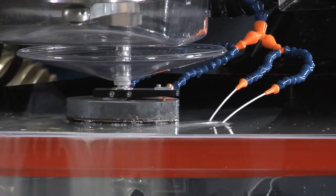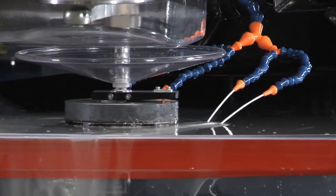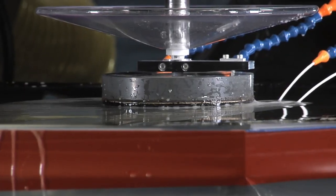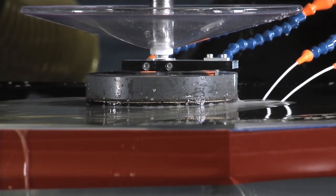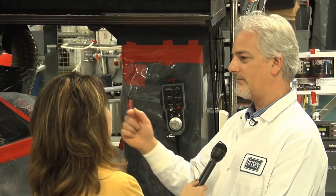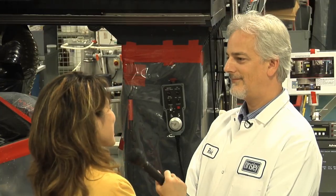These are not flat mirrors, but you want that surface to be very continuous. If it has roughness in it, it won't perform well, because each little lump and bump on the surface reflects light in a different direction, so it doesn't come back to the detectors. This process helps it to be extremely uniform, so you have the maximum amount of surface area returning the light. These processes — rough polishing and smoothing — are done over and over again to make sure the mirrors on the James Webb Space Telescope have a smooth surface and the correct shape.